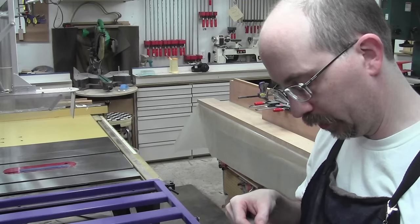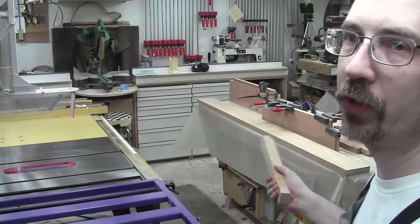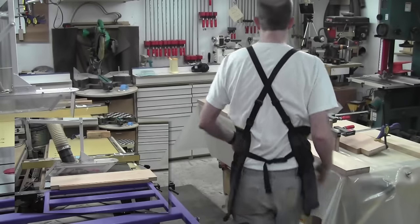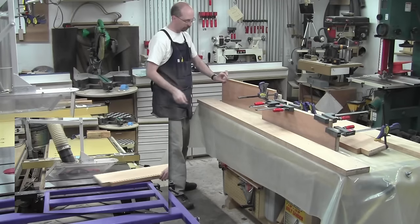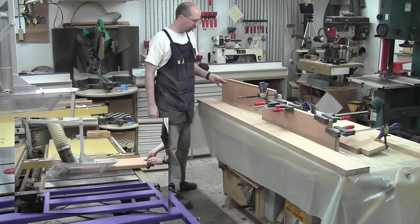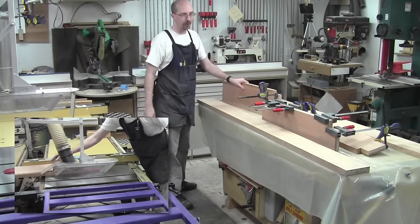So what I'm going to do is, where I've put 3/4 of an inch extra stock on, I'm going to dial it back a little bit. For example, on this bottom rail, I didn't get veneer all the way out to this edge. There's a big old gap, more than a half inch. So I'm going to trim it back so that when the profile comes in, it'll just hit where the veneer is. That's the plan. That also will get me a consistent parallel width for that.